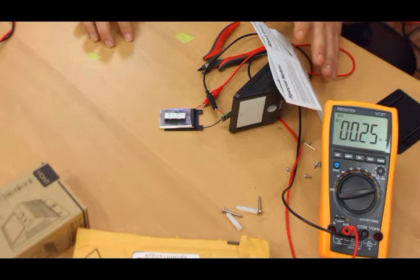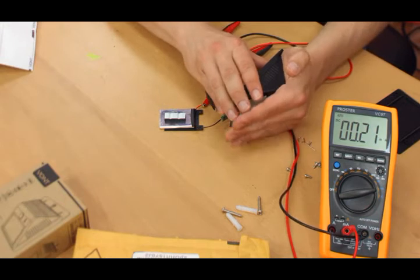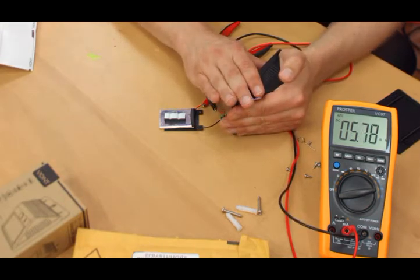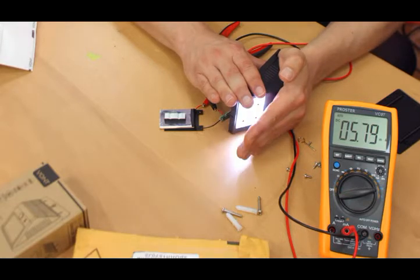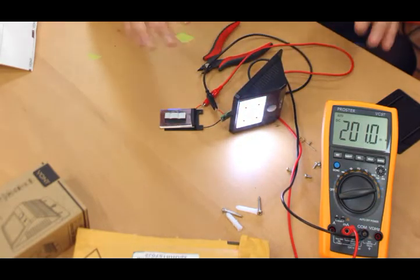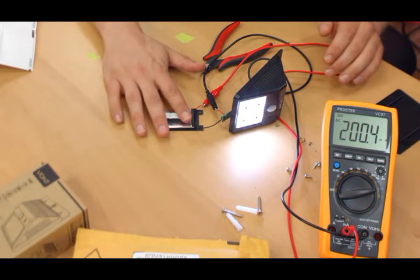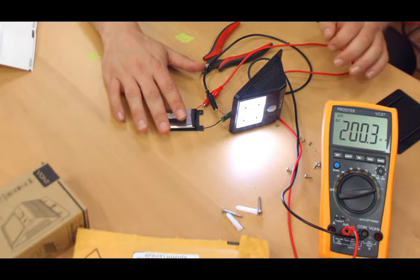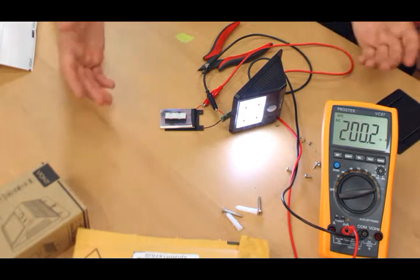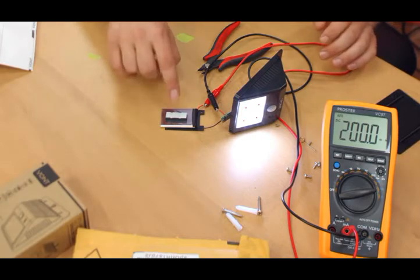I also tapped into one of the wires coming from the cell and found that while on full brightness the fixture drew a current of about 200 milliamps, which means it's consuming just under three quarters of a watt. The quiescent current draw with the solar panel shaded was a measly 0.27 milliamps — barely any power at all. That's quite excellent and indicates the circuitry was fairly well designed. However, when the solar panel provides no current at all, the fixture goes into nightlight mode, meaning the LEDs draw a small amount of power even when there's no motion. The current draw in low power mode is about 5.8 milliamps, which is quite reasonable and would probably allow it to stay illuminated for quite some time. Based on the battery's size and weight, I'd guess it's probably somewhere around 750 milliamp hours.